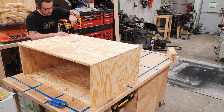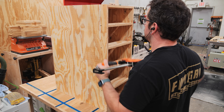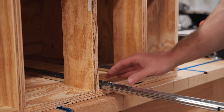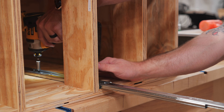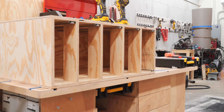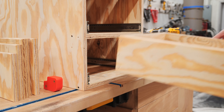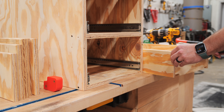The CNC pre-drilled holes so I could assemble the cabinet using screws, and I glued and screwed it together, which went really quick. I also assembled the drawer boxes using narrow crown staples and glue. I ended up using over-extension slides from Rockler on this cabinet, although the CNC had pre-drilled mounting holes for Blum undermount slides. Unfortunately, I didn't consider that selecting Blum undermount slides would slightly change my drawer box dimensions, and it was at this point that I realized my drawer boxes were about 3/4 of an inch too wide because I had selected the wrong option in the software.